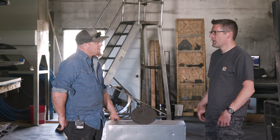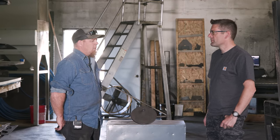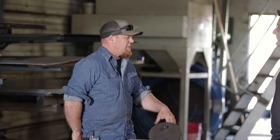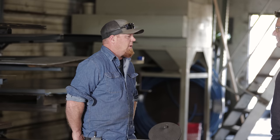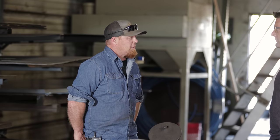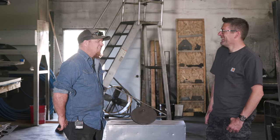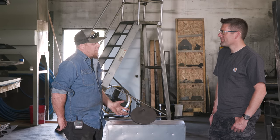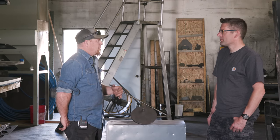The water bath keeps the heat-affected zone in check and keeps the temper of the steel unmodified as much as possible. There'll always be a little, but it's very minimal. How many targets are you cutting at a time? Ideally I'd be cutting whole sheets at a time, but often a customer will order a special target and I'll throw a sheet on and cut his target along with a couple others to fill in inventory. I'm not afraid to cut a quarter sheet or even a single target. For hangers, I'll cut whole sheets or fill remaining space on a partial sheet with hanger components.